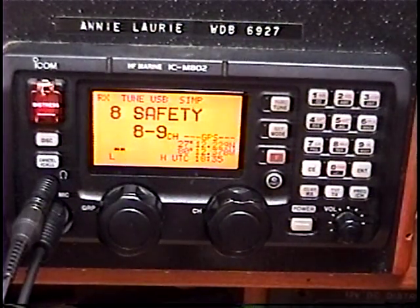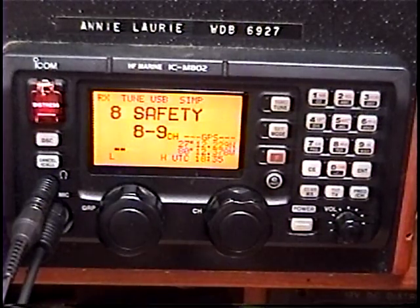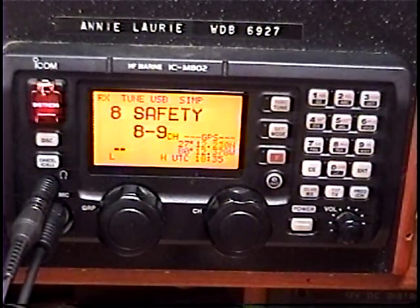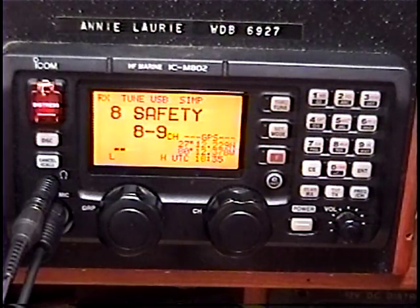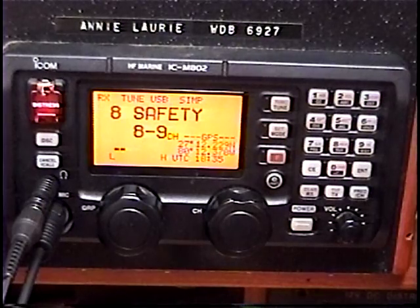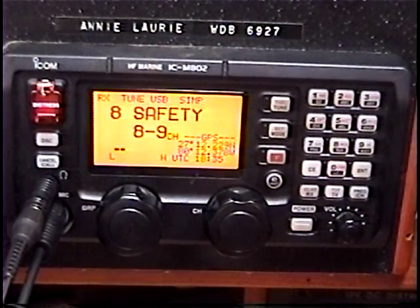To make a long story short, a few of the key things to remember when trying to eliminate onboard radio frequency interference: install your radio correctly, use clip-on ferrites judiciously, have a very good grounding system for the antenna, use good high-quality cable, and run cables away from other systems on board. Most of the problem, though, is usually in everything else on board that was never installed with any consideration to how much radio noise it actually transmits and radiates.